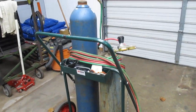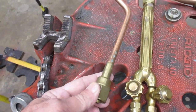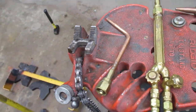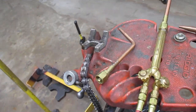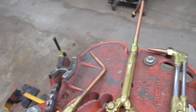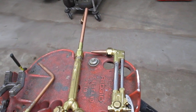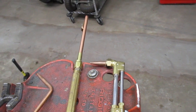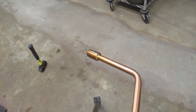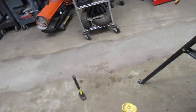This is my oxygen-acetylene rig. You've got different types of torches. This is your cutting torch — I'm not cutting though. I need a lot of heat. This is a brazing or welding tip; you can gas weld with it — it's becoming a lost skill. Brazing is brazing. And this is called a rosebud — massive amount of heat over a decent-sized area.